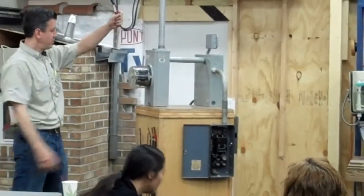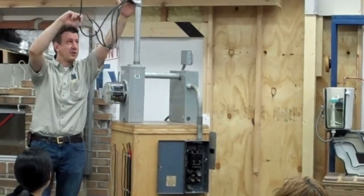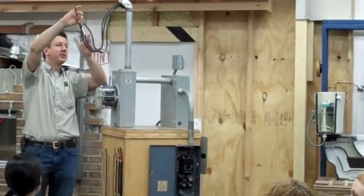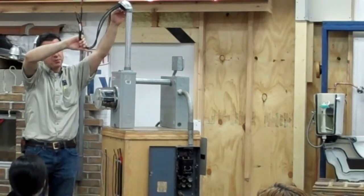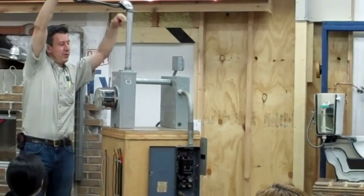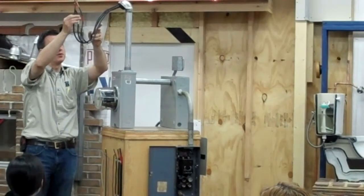House, we have your meter housing, your service mast, and your masthead. What we look for when we're doing the inspection is you have these wires bundled with a little bit of a loop, and that's just so that when you have rain hitting, you don't get moisture running down this pipe. If I took the service and brought it up over here, all the water would feed down in here, and you'd be introducing water into your electric service. So when you come into the service, you want to see a drip loop to the wire.